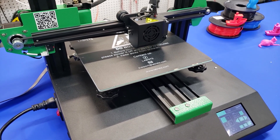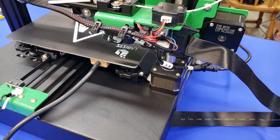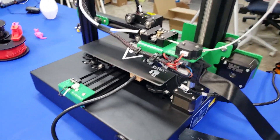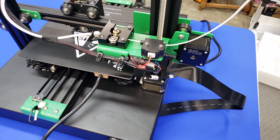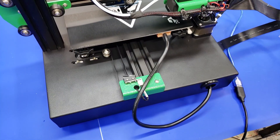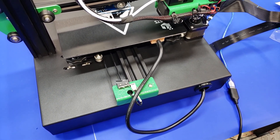Moving it around and picking it up, it's a very solid printer. Taking a quick look at the back, we see the filament runout sensor and a traditional standard extruder. The back also has a pretty solid cable going to the heat bed. My one concern is that this large cable does pop up over that extrusion and green plate, and ends up rubbing on the limit switch. That could create a problem over time, causing the wire to wear out or causing wear and tear on the heat bed cable.